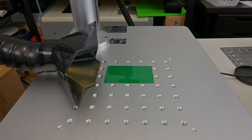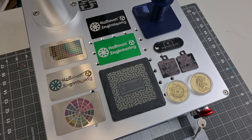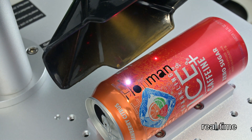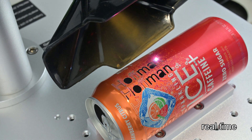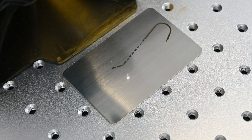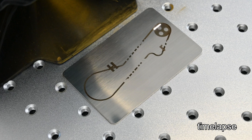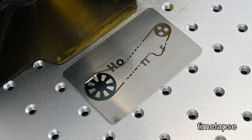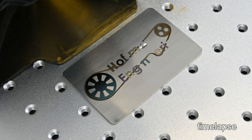In conclusion, I found the Omtek Mopa Compact 20 a very capable fiber laser. The Mopa laser source gives you that extra bit of control when compared to other non-Mopa fiber lasers. The extended 1kHz to 4000kHz frequency range, along with the Q-pulse duration adjustments, lets you fine-tune the settings needed for almost any material. The Mopa Compact 20 is a workhorse for metal engraving with its deep engraving capabilities, and the colors achieved on stainless steel are breathtaking. While I wasn't impressed with EZ-CAD, the fact that the Mopa Compact 20 is Lightburn compatible makes up for that. It will require a bit of testing and experience to find the best settings for any new materials, but once it's dialed in, the results are spectacular.